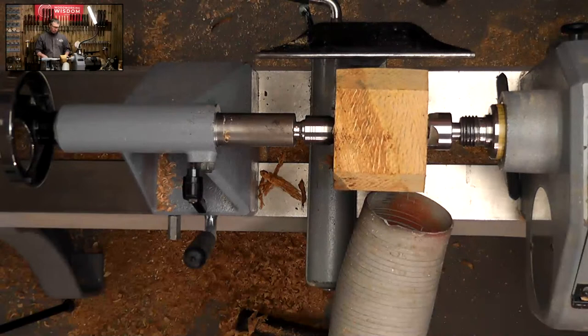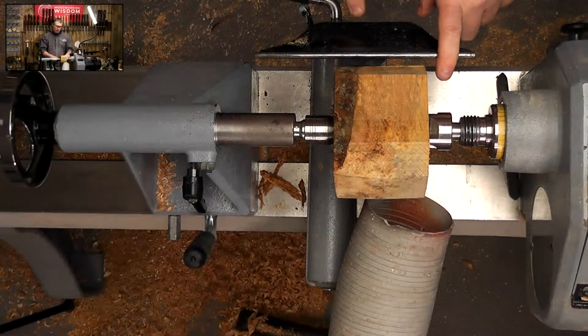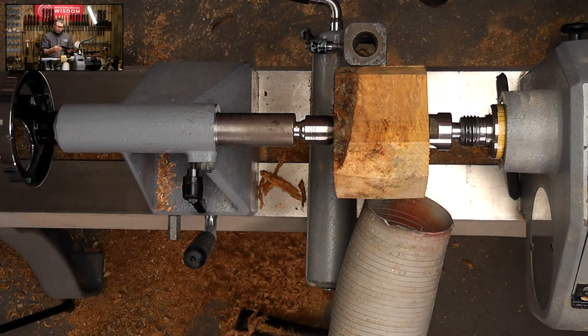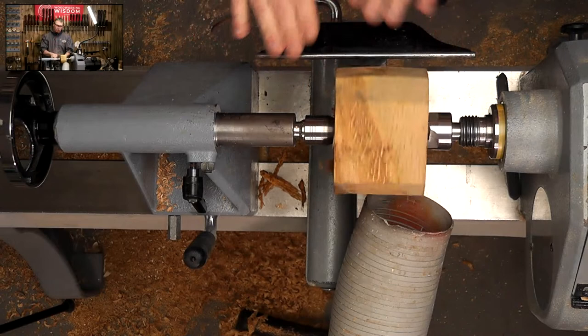When I leave the lathe after my day's work with the timber, everything gets a wipe down, and that includes things that you may not think about. So the quill of the tailstock, the stems of your lathe, the internal part of your banjo. I know I'm talking about these, and I've got a stainless steel tool rest and all that sort of stuff. Not everybody has, so it's still a good habit to get into. The other thing, of course, is the steel of your tools if you don't want them to get blue.